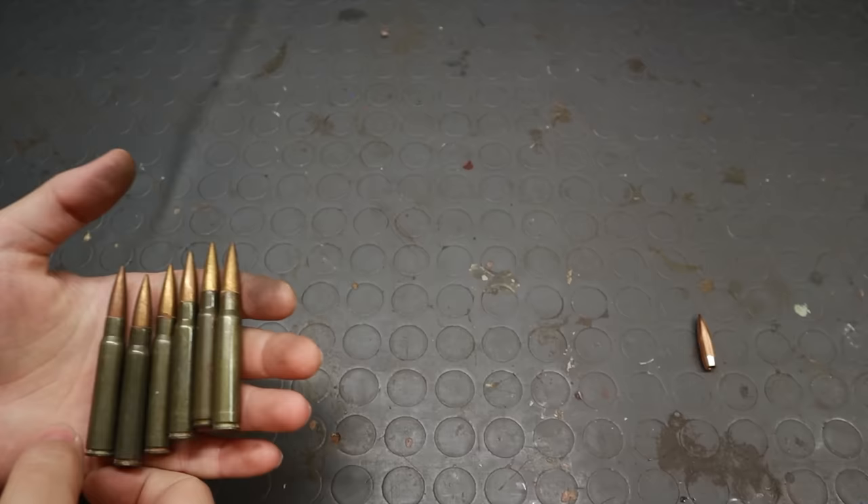All this complexity had to fit in a small and lightweight package, and that's where problems arose. The FG-42, both first and second type, was crippled with reliability issues due to component wear and premature failure. Because of the weight restrictions, there's simply not a large enough safety factor on all parts but the barrel itself, and all sorts of breakages occurred even during the official testing by Germany before adoption. Even though I was able to fix the trigger group on this example, we still encountered a lot of trouble during testing, with the main issue being failure to feed during cycling.